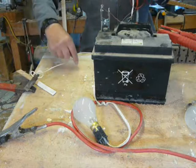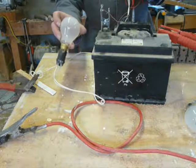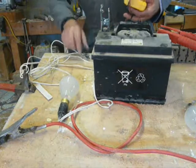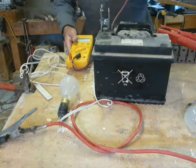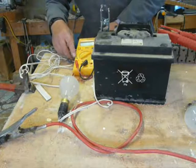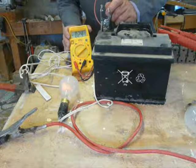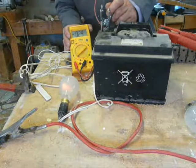The positive goes down this white wire through the light bulb, which is a 240 volt 150 watt incandescent bulb. It goes through the light bulb and out to the meter. We've got the meter set on DC amps, 10 amps. The light bulb glimmers and we're showing 0.24 amps — near as damn a quarter of an amp.